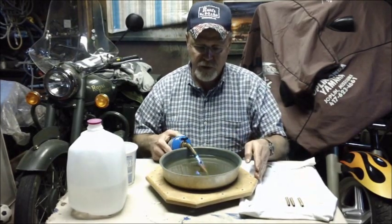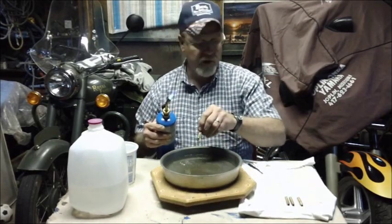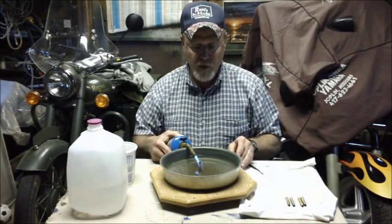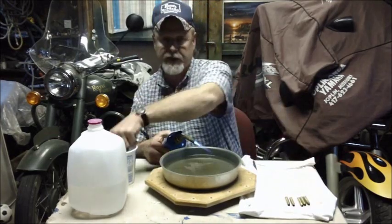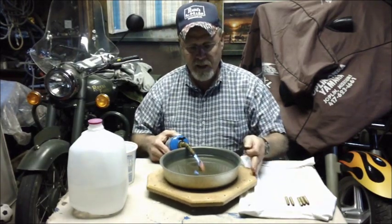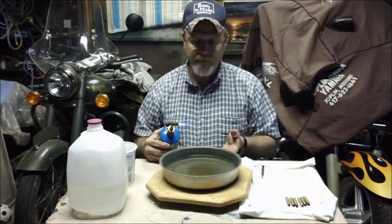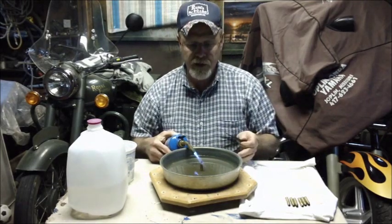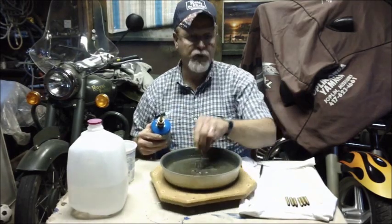308s take a little bit longer. Since you shoot 308s and 223s more than anything, you want to take good care of your brass and you'll find it's very consistent. If you've got a couple hundred pieces to anneal, you might think it'll take forever — but it really doesn't. Once you get rolling, leave it until it starts to get pink and then rotate it around. This is also a good time to look for cracks, because as you heat it up you'll see them. After about 25 or 30 cases, the water gets pretty warm and you'll need to change it out — you can add ice cubes, or just dump it and refill to three-quarter inch. Consistency is the name of the game.